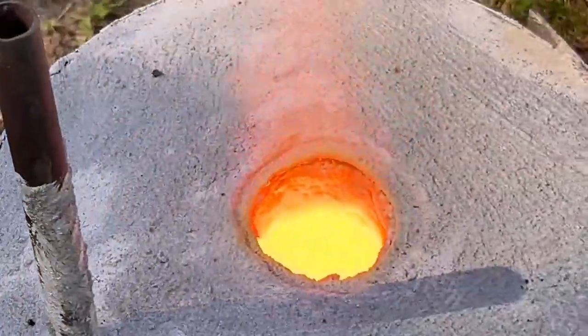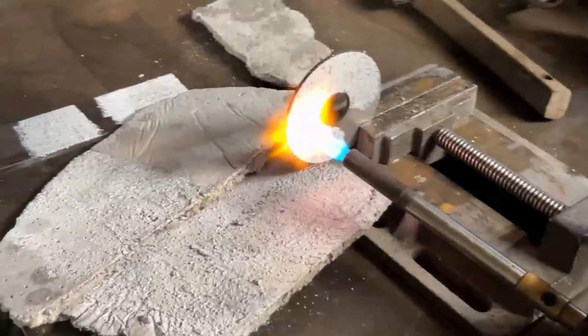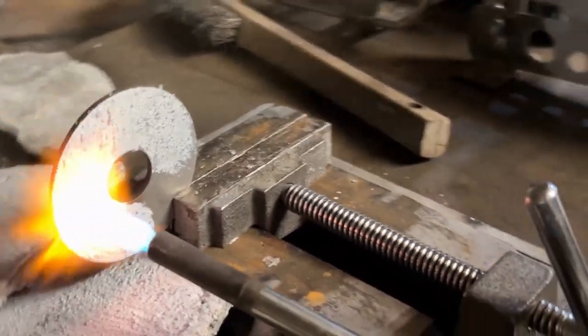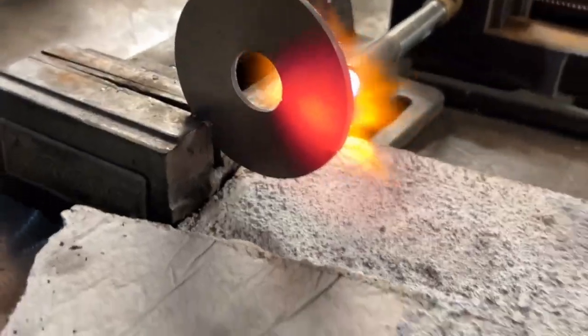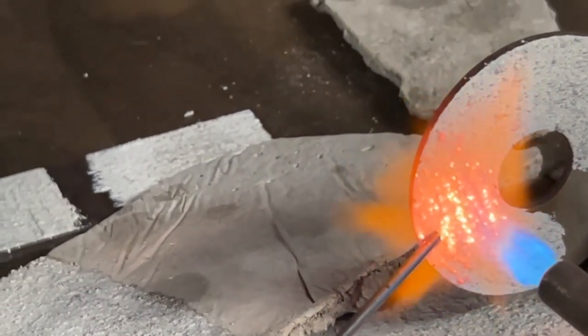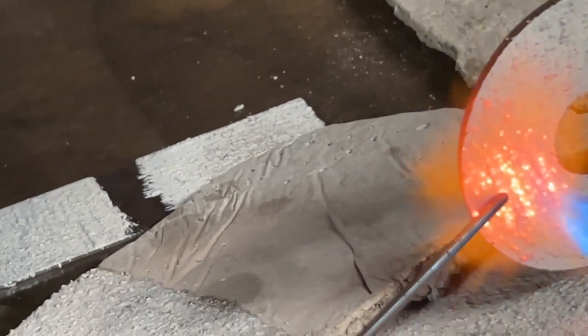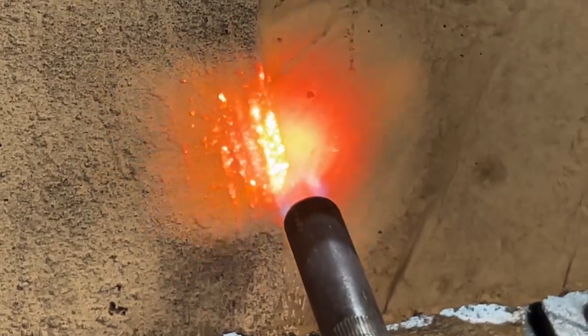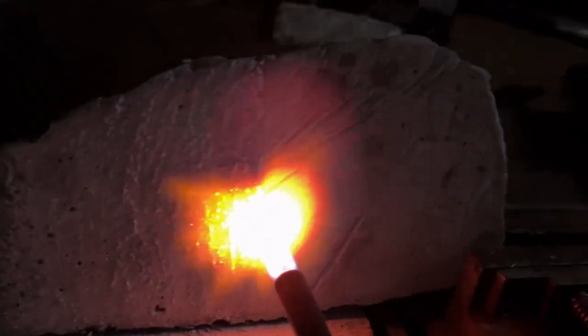You can see here on the top of the furnace that it's also doing very well. So we're going to be taking a look at this new high emissivity refractory coating that I've developed. I haven't honed in on the perfect composition just yet — we're still putting our feelers out there to see where we want to start testing. You can see here that it's definitely shining brighter on one side versus the other. On the front you can see we're shining a little brighter on the high emissivity coating.